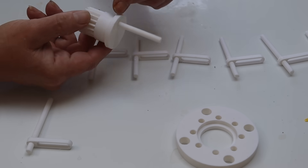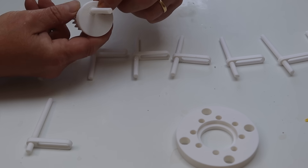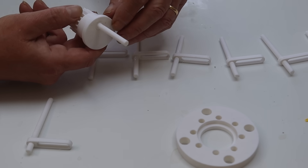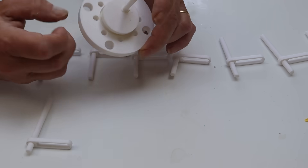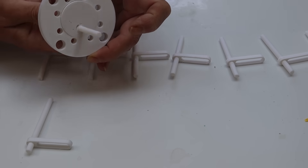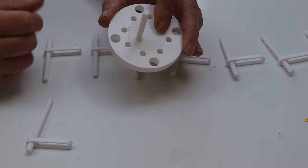To illustrate this, we're going to use this Scotch yoke eccentric, and I've put an extra long pin on it. We're going to use the fixed Scotch yoke just to illustrate it. Later on, we can swap this out for the variable Scotch yoke, and we're going to put this in this circular base plate instead of the square latch. Just like the Scotch yoke, if I rotate that, then that becomes an eccentric that moves in a particular way.